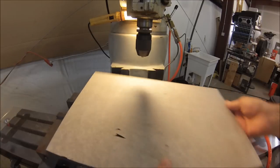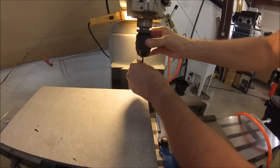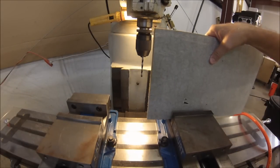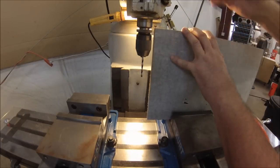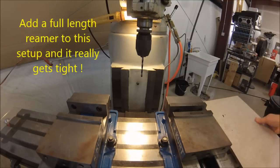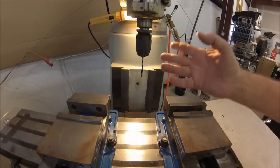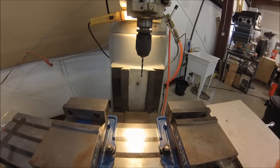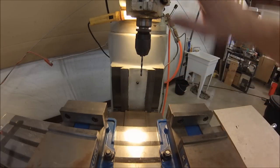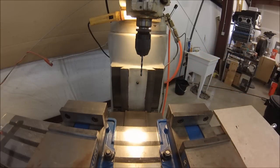Alright guys, here's the deal. You've got a big piece of LE phenolic, or aluminum, or wood, or whatever else it is you want to do. If somebody wants a bunch of 5/16ths holes in the side, when you stick this in your vise you can crank your table all the way down and you're just going to run out of room. A lot of times if you have a 12, 13, or 14 inch thick plate, it's just not going to happen. You can save some room by putting your tool directly in a collet and buy yourself about 3½ inches, but if that's not an option, take a look at how I did it. Slide the table back, slide the head back — you have an awful lot of room right here that's not being utilized, and also room to either side of the machine. But for right now, let's take a look at what's in the back.